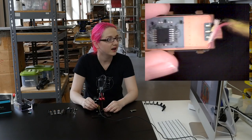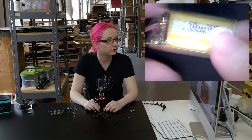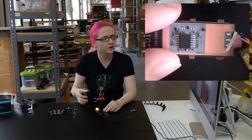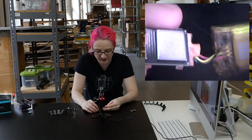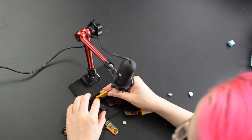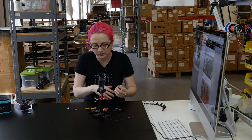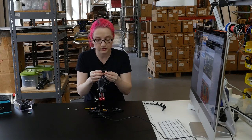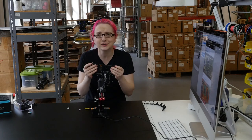Each of these modules is connected one after the other, and this one also has the battery. Interestingly, instead of having one large battery, they split the batteries up so they could get two 260 milliamp-hour LiPoly cells rather than one big 500 milliamp-hour one. It's a little more expensive and you have to worry about charging and balancing them separately. This one has a three-pin connector, which makes me think there's a temperature sensor or some balancing control inside. It's quite an intense manufacturing process, but they really wanted something very slim and elegant — split sensors, a complex flex circuit, multiple batteries, a hardcore processor, Bluetooth Low Energy, and a lot of analog circuitry. This is the most advanced wearable and definitely in the most 'I'm surprised it works' category. Congratulations on making something that works.